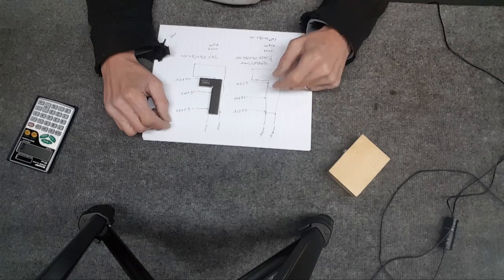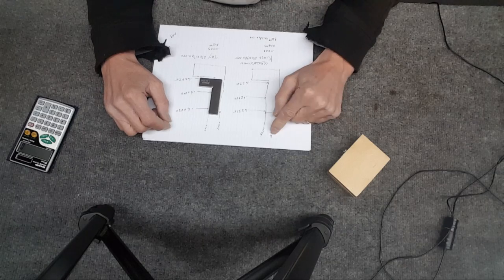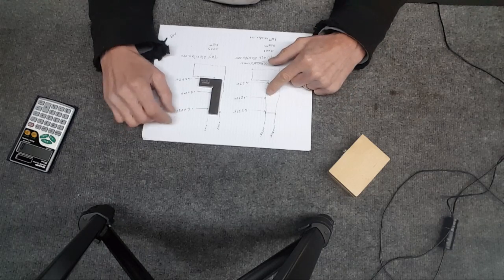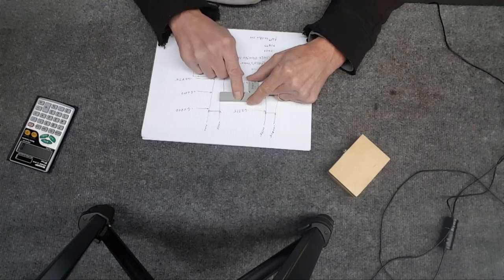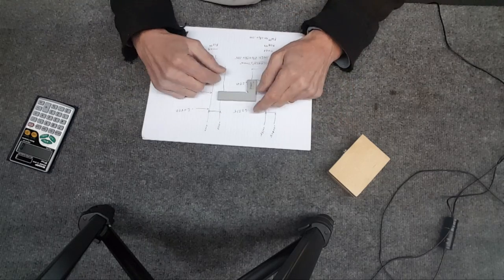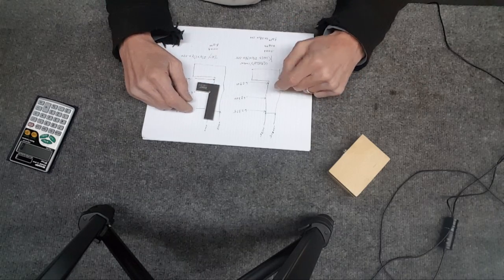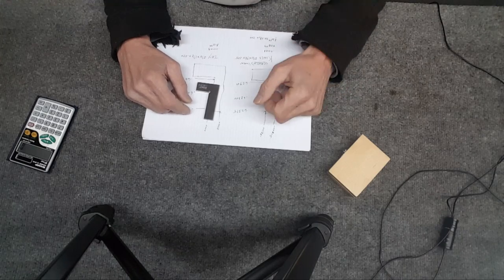But this guy is advertised to be square to a tenth of a thousandth. I'm measuring 3/10 of a thousandth out, so that's why I'm sending that back. It also had some funny grinding marks on it, like it was ground from here to here, and then it shifted, and it ground from here to here. So you see a plane of here, and then another plane. So maybe, hopefully, it's just messed up. I mean, since this one came in so good, I'm hoping the replacement will be cherry. And likewise, I hope this 4-incher will be too.